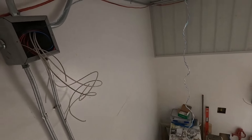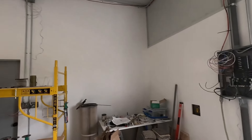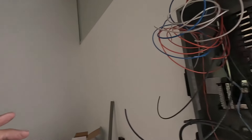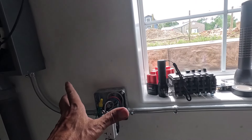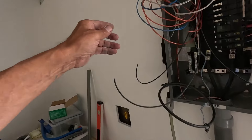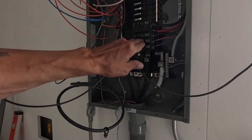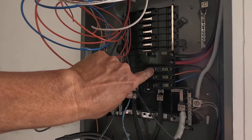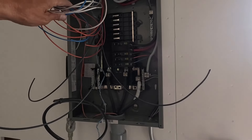That is it for the major pulls for right now. With everything pulled, none of these wires are touching anything where they're going to get electrified - and it probably wouldn't really make any difference if they did. But now it's time to get those identified. I taped this up because I can't get that put together yet, but this one is done and I have an extension cord going over to here so I'll have lights. The breakers I put in - these four right here - are all off, so I'm going to go turn on the power and then turn on number one, flip my remote, and I should have light, then I can start identifying these.